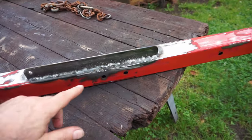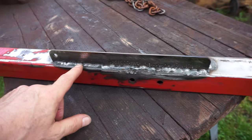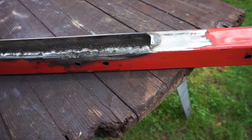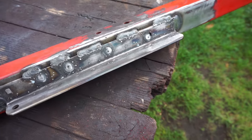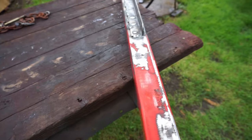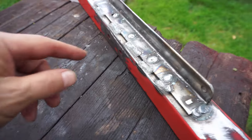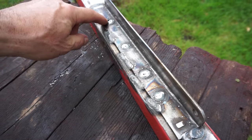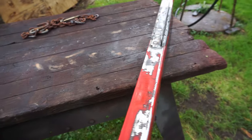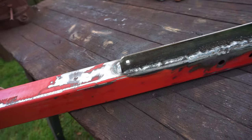All right, it's all clean. I ran into a little bit of an issue here - some burn-throughs on full power. But these look good, this is good here. I had to turn it down and build it back up. I turned it down for this last run which is really where I should have been - you can see the difference. I was more concerned about penetration and having it be really hot. I also got my arm a little too much UV.